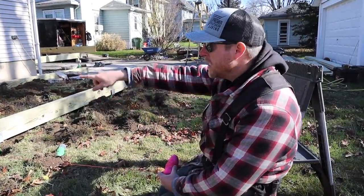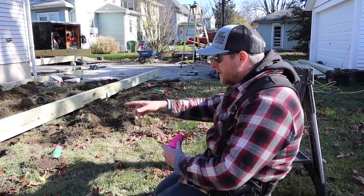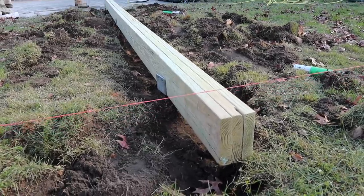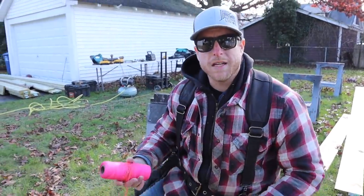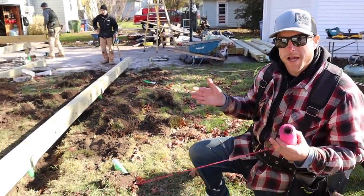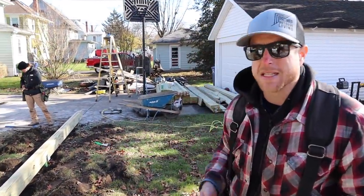Pick a wall of the house, run a string line pretty far down it, and then you're just going to move it until right there — I'm just touching that corner. Our first beam's already lined up. Since these beams are full 20 feet, they're about 240 inches. Usually they're at least a half inch more than that, and we need to cut these down to 236, so we have two inches of play on each side. We're really close to where we need to be, so we know we're going to have some wiggle room here. This is good to go. Now we can start laying in our joists after we set this beam.